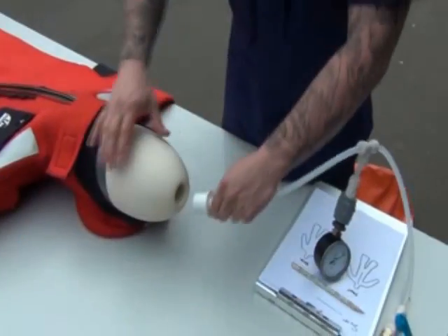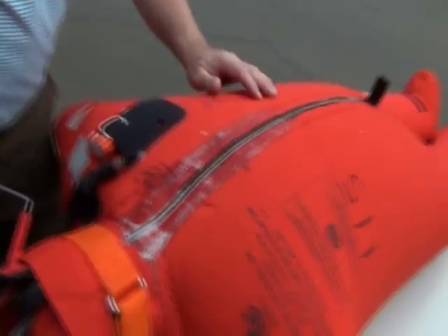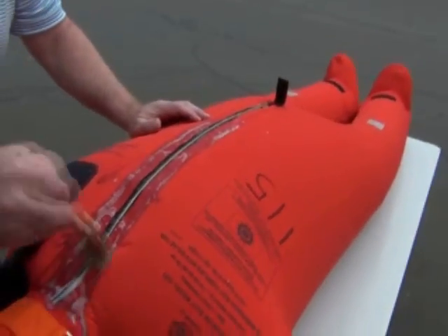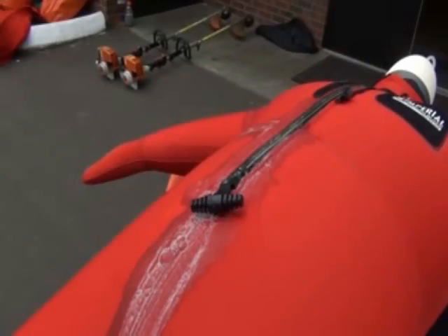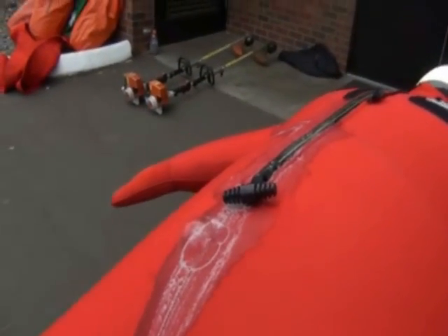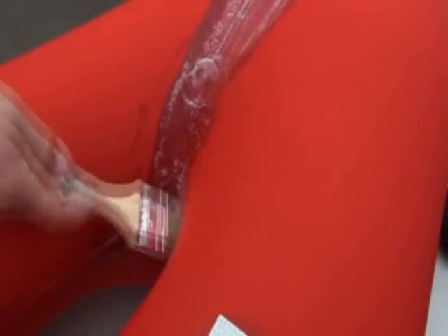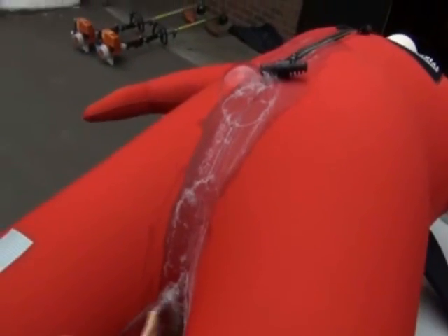The MSC Circular states that the unit should be inflated to a pressure of 0.1 to 0.2 psi, and then a soap solution be applied to all seams. A leak is evident by the presence of bubbles. The air pressure of 0.1 to 0.2 psi was found to be insufficient for suits that are stiff, as it does not fully inflate the extremities such as hands and feet. These suits were inflated to a higher pressure.